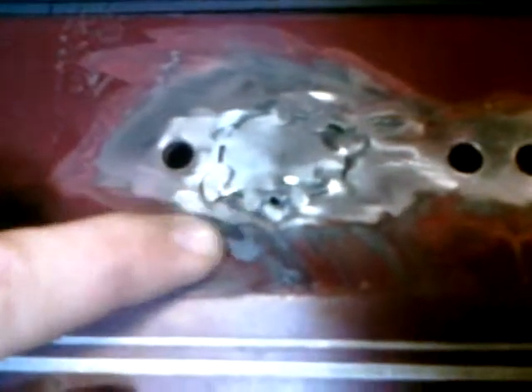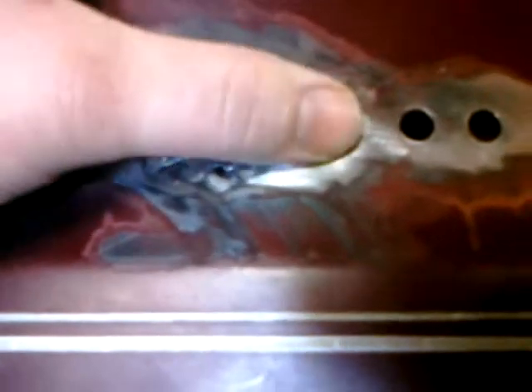We got some of these spot welds ground down here, let me show you what we got. See right here, this is where I burnt through, but that's not gonna be a big deal. Just a few more little tacks here and there and fill it in. It's nice and smooth. I didn't grind them all the way down but I got them down far enough where there's no big points or anything gonna make a hot spot.